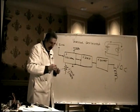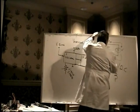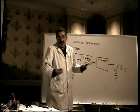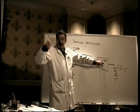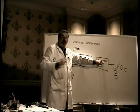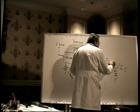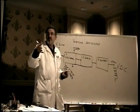Well, if we look at what we have here, and forgive me for being so abbreviated there, not enough time. The vertical output chip is the source of our vertical drive. I mean, that's the thing that's going to drive the yoke. And these are the brown and yellow wires. Remember I said that we have brown, yellow or green, yellow is the color for the vertical pair.